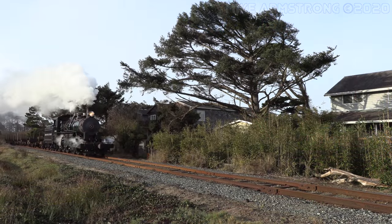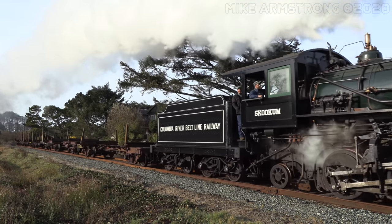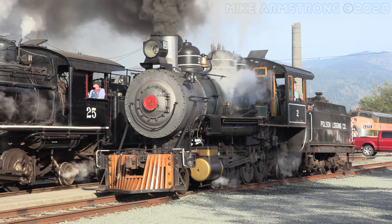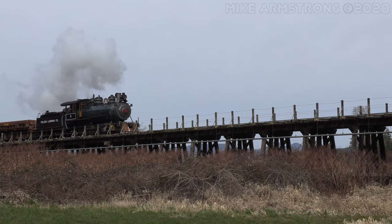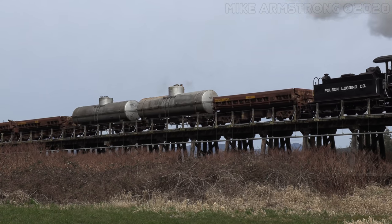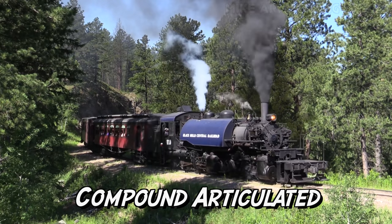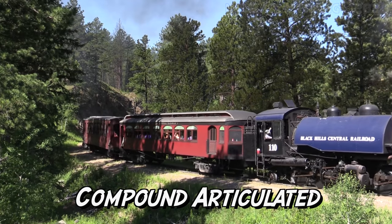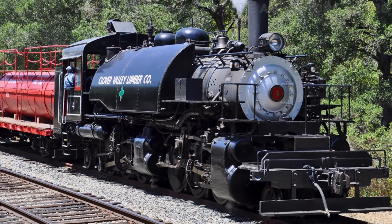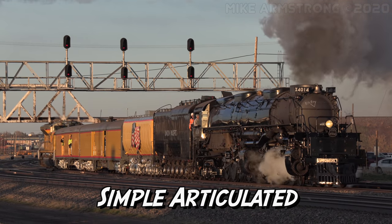The Mallet was also one of the first uses of compound steam locomotive technology. A compound locomotive reuses steam after it has cycled through a set of cylinders. In a traditional steam locomotive, water is heated in the boiler to make steam, and the steam, under high pressure, is then piped into the cylinders on each side of the engine to push a piston and make the driving wheels turn. After steam is used in the cylinders, it leaves the locomotive through the smokestack or chimney. In a compound articulated steam locomotive, the steam first travels into one set of cylinders at high pressure, is used, and then enters a second set of cylinders where it is used again at a lower steam pressure. This can significantly increase efficiency of a locomotive by using up even more of the available energy from the steam. Simple articulated locomotives, on the other hand, use steam only once in each cylinder, just like a traditional steam locomotive. Steam from the boiler is piped to the front and rear cylinders at the same time and at the same high pressure, and once it is used, it is expelled from the locomotive.